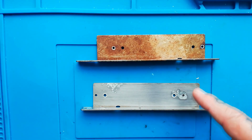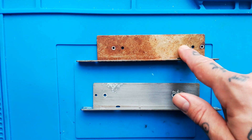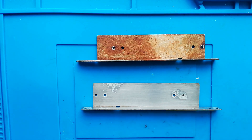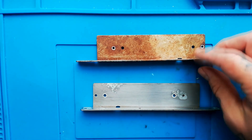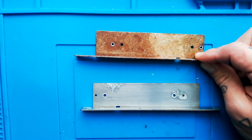The way I've handled this kind of thing before is just by using white vinegar, a substance you've probably got in your kitchen cupboard. If you leave something like this soaked in white vinegar overnight, then the corrosion comes off pretty easily — might even wipe off, or maybe you use a little bit of wet/dry sandpaper afterwards. The two big disadvantages of doing that are: first, you need a container big enough to soak the part, and the other is that it smells.